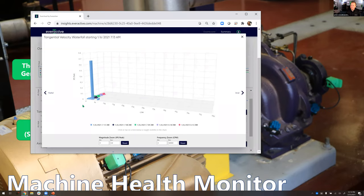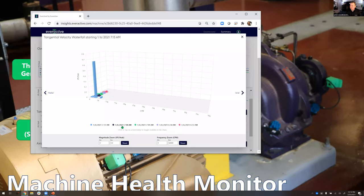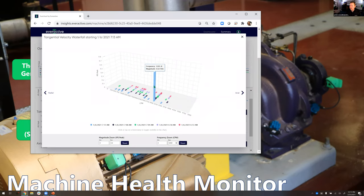In our waterfall view here, you can see a 3D depiction of that data. I'm looking at the 5 most recent minutes here. We're on 5-minute centers, but we could go down to individual minutes. We could also stack up 5 days worth of data or 5 weeks or 5 months. We keep all that online for you. Looks like most of the action here is under 5,000 CPM. So you can zoom in and take a look and find those outliers when they pop up.